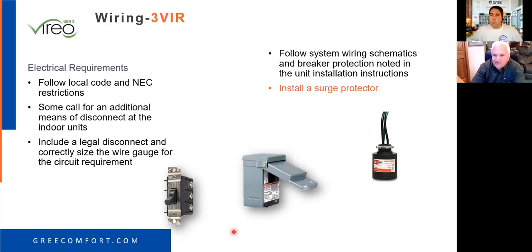Now on our side, we're trying to really strongly dissuade them from doing it. But as the new code comes in next year, I think you're going to see this more and more throughout the country. So it's real important that if you do have to do it or you run into it, that you use the right switch, or else you're going to have communication issues. Oh, most certainly. And I think the code requires that all 3 wires be broken. The problem with that is if you splice or break a communication wire, it always ends up being an issue. So if you use the proper switch, it's going to properly reconnect that circuit so that it doesn't break communication. And if you do have to use a switch, make sure you use crimp on terminals to put on the screws, to go the extra mile, not to cause yourself a service issue down the road. Oh, most certainly.